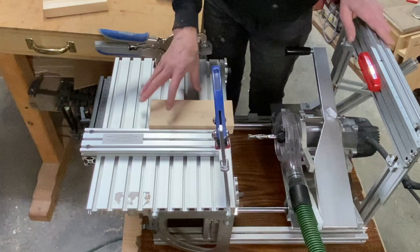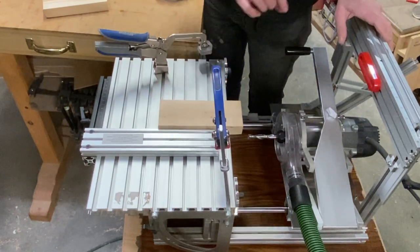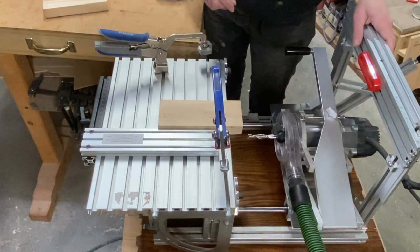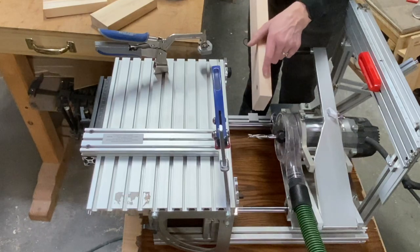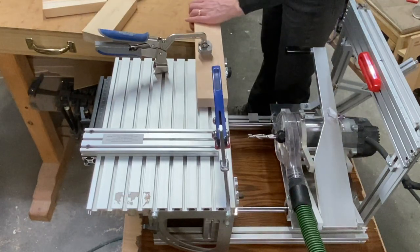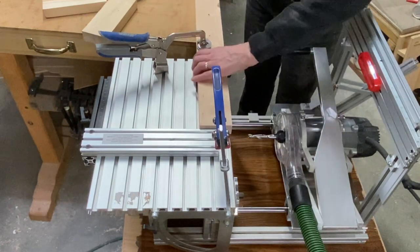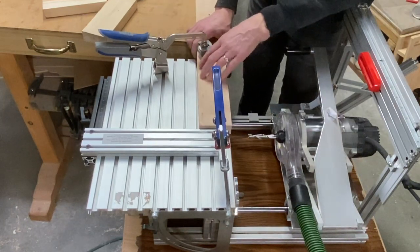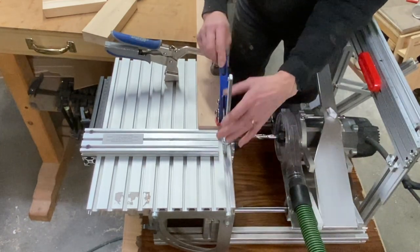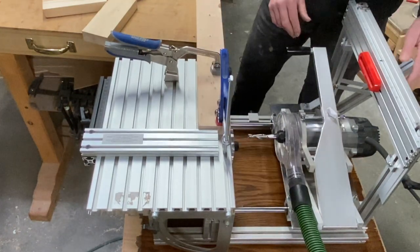When I do the tenons, I'll be putting these pieces here. I want to do the mortises first so that I can fit the tenons into the mortise and hone in on exactly where that should be. I marked which end I wanted to do those on. You can see that my table here works great as a support base. I'll get this tight with the front, clamped in firmly, and I always like two clamps so I put a second clamp on that end. It's really locked in well.